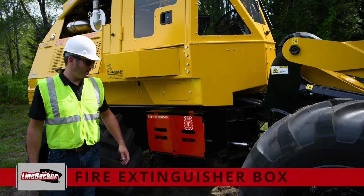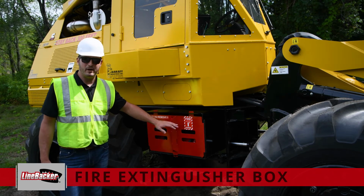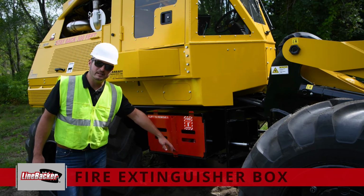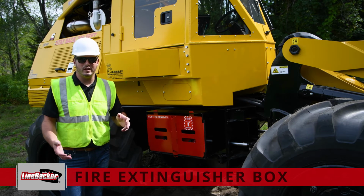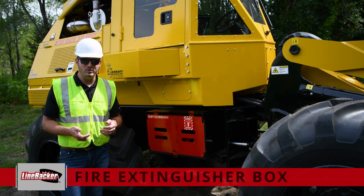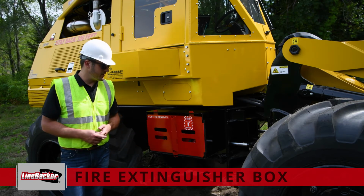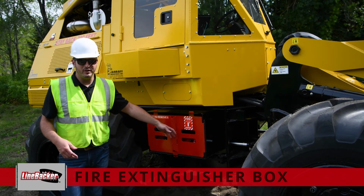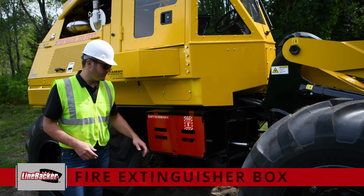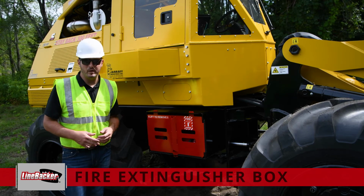On the right-hand side of the Linebacker, we do, as a standard option, mount 2 20-pound fire extinguishers to the machine. The cover for this does have a locking tab, so if you do want to lock those overnight, you can do so. It's always good practice to undo those locks and take them off during the day. If something were to happen, obviously you don't want to be running around looking for keys to get at the only thing that's going to stop a fire. So if you are locking this, be sure that you take that lock off every morning before you go and operate the piece of equipment.